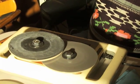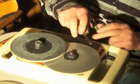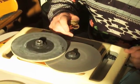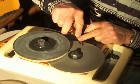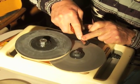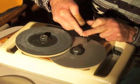To do a gouge, same way. To grind it, I just go away, always sharpen away from the cutting edge, establish my angle of attack that I like on the tool, and then just start rolling the gouge back and forth. Keep a little pressure on it.